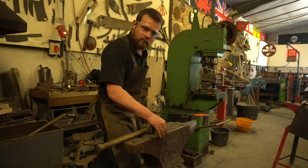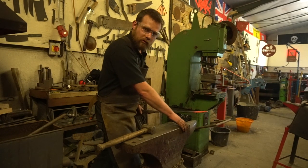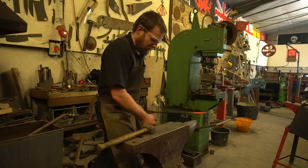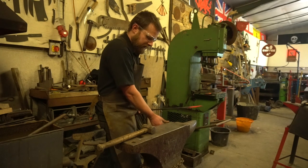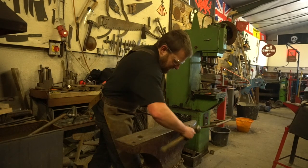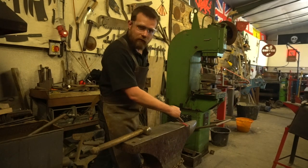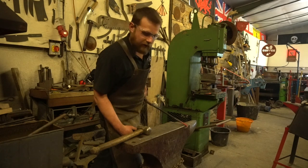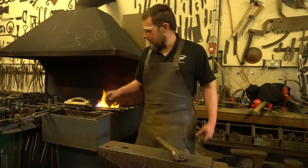On mine I've got a sharp radius on one side that widens slightly to a broader radius up by the cutting table, and I've got exactly the same on the inside of my anvil — a quite sharp edge by my hardy and a bigger radius on the other side. That makes a big difference when you're bending around the anvil, so you're not marking and galling the inside edge.